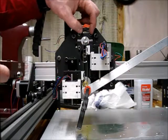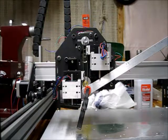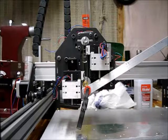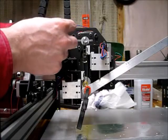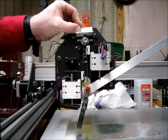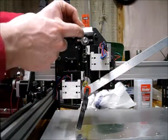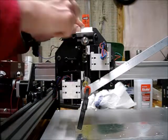Next I need to put these two bolt or screw holes in. I know the size of the screw and I know they're 31 millimeters apart. Looking up the motor — it's a standard NEMA 17 — so I'm going to center the two holes in the plate this way and then just measure down from the top to place them. Once that's done I'll probably have to cut a chunk of this, because once it's mounted I'll know the distance between surfaces and can drill the mounting holes.